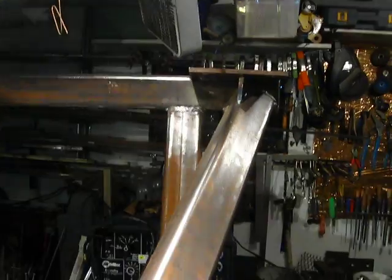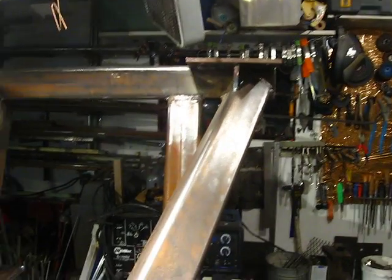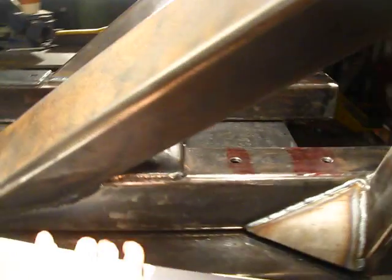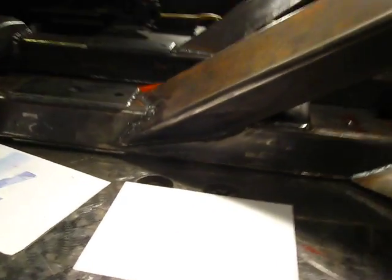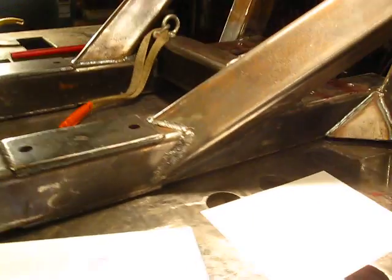This one connected closer to right above that vertical and I liked it coming out a little bit. That plate up there is where the crow's nest is going to mount to, so I wanted to give a little extra support to that. I definitely needed the support near the cog because otherwise this point right here would take the whole moment load. I was actually able to slide this tube right over a piece of 4x4 tubing, then transfer those lines all the way around and cut it with a torch — probably went a little bit overkill with the weld, but it's definitely beefy enough.